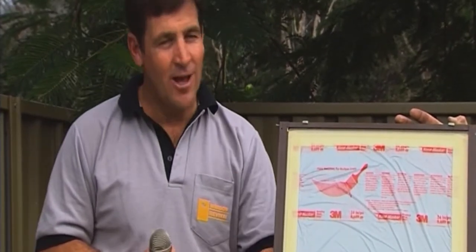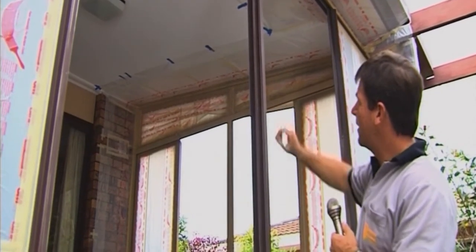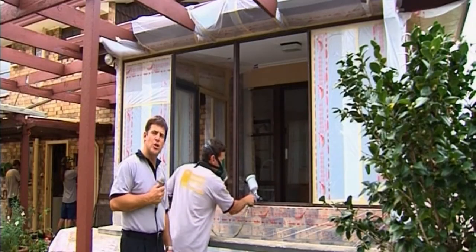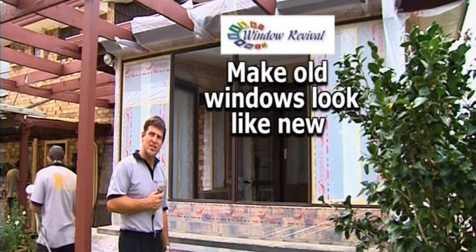We're moving over to the fixed panel now. Jamie's just finished the fix sashes off. Notice up on the ceiling you'll see a different color tape — on the wall we've got the yellow tape, and on the ceiling we've got the blue tape. There's a reason for that. 3M is one particular type of tape maker, but there are other types and different grades of stickiness. Some are very fine — for ceilings, this is the lowest grade you can get. We use it on ceilings and also on the internal window reveals so it doesn't pull off paint. As you can see, the first thing you hear is the gun going but there's no paint coming out — it's just air, making sure we've got a good surface to work with.